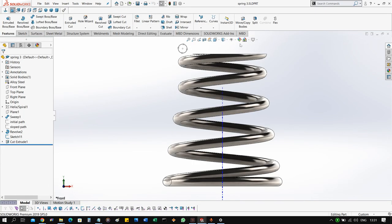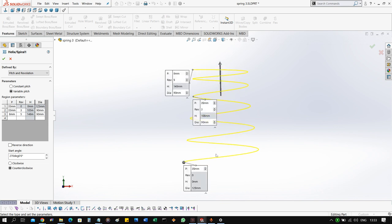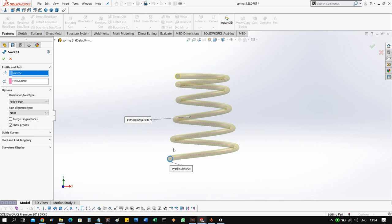Next we have the spring itself. The spring uses a helix feature with a profile that revolves and circulates. From the circular sketch we add a spiral or helix feature. The spiral moves at different pitch heights — on the top it looks more compressed and the bottom is less compressed. This is done by adding custom lengths and revolutions: for 35 millimeters you add three revolutions, and for a further 8 millimeters you add five revolutions. You can also define a starting angle, which moves it up or down — it's totally custom. Then to complete the profile you add a sweep feature, selecting the sketch profile and the helix as the path.